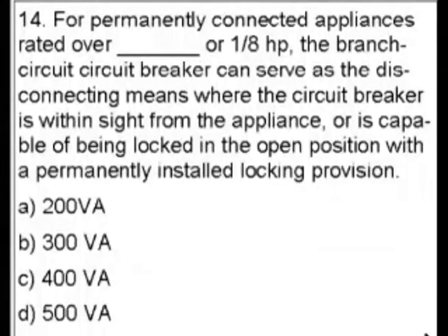Our main keyword we're going to look at is appliances. There's a whole section in the code book on appliances, and we're going to pay special attention to permanently connected when looking at appliances. You might think branch circuits or circuit breaker, but those sections have an awful lot of information packed into them. We're taking the test, we've got to find an answer quickly. We're going to take a chance that it's appliances, and it's going to tell us about disconnecting and things having to do with overrates and circuit breakers for different types of appliances.